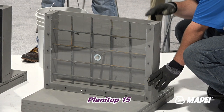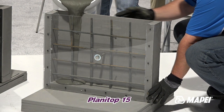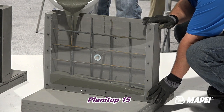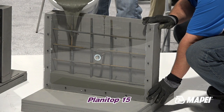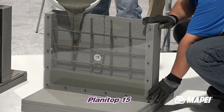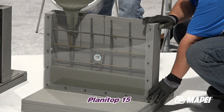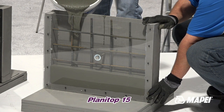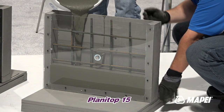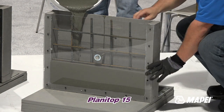It's very fluid, a very fluid material, and that's what you want. Let's say we had a 20-foot beam, and we start at one end with our spout, our entry port, head box, and we've got to run at 20 feet. Obviously, this one will do that. It'll run 20 feet, 4 inches thick, push itself out that exit hole, driving the air out, and when it cures, it'll be part of that beam. And that beam will be enlarged and therefore strengthened.